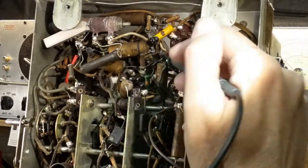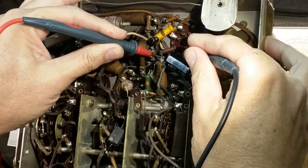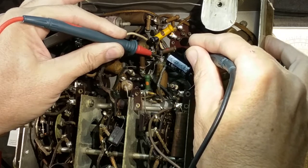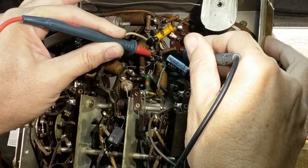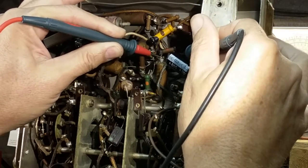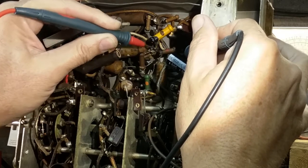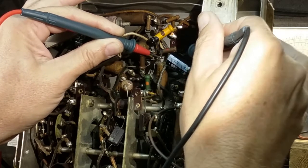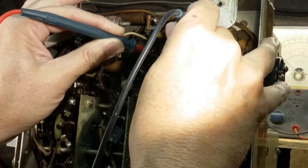This one's a little out. This one here is a 2K, 200 rather. I'm sorry. Red, black, brown, yeah. 200 ohms. Okay, I'm getting, that one's got a problem. I'm sorry, it's the other way around. It's a 1K, duh. My brain is concentrating on trying to get the probes on, I'm not really looking at the color right. So it's 1,000, and once I get the probes to make contact, they're not doing it. Old solder joints are hard to connect to without something to help.